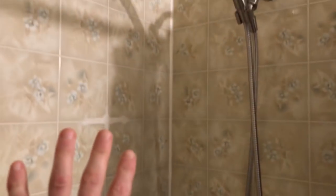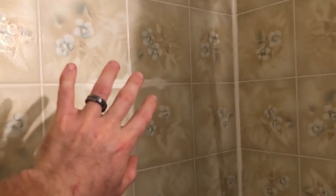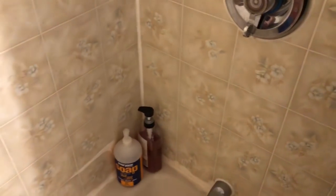It doesn't look the greatest, but my goal was waterproof. It didn't look great anyway because there were brown cracks where it was split open and inviting moisture in. But now those are covered with nice waterproof, mildew and mold resistant caulk. I could have used clear caulk, but it wouldn't have looked any better because it would have shown the brown exposed material that was behind this. So I chose to just do it in white so I could see that I was really sealing everything well and wasn't leaving anything uncovered.